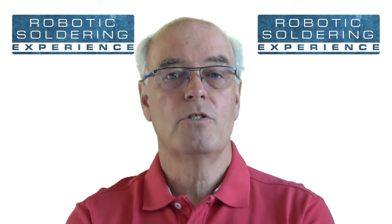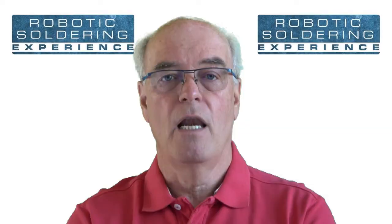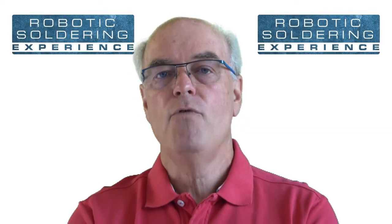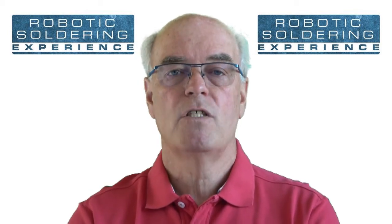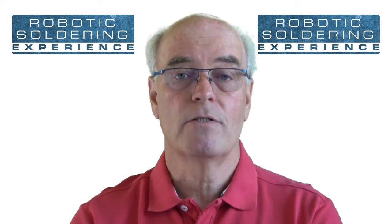This week I wanted to talk about hole fill. Now most people on a plated through hole want to achieve a minimum standard, and those standards are defined typically in IPC 610, either level 1, level 2 or level 3. In reality, most people want to see a minimum of 75% fill. They want to be able to see some evidence of a solder fill visible.